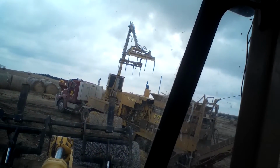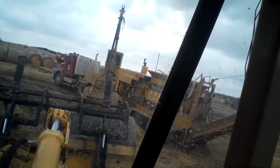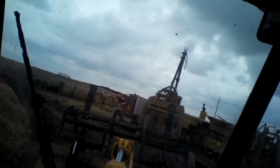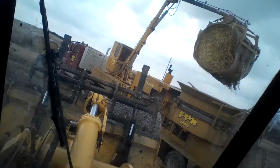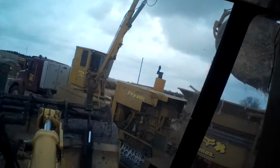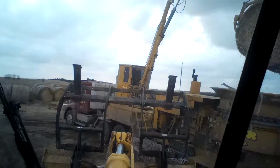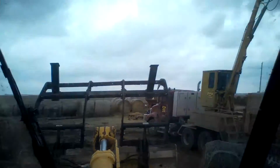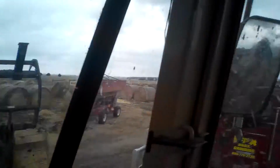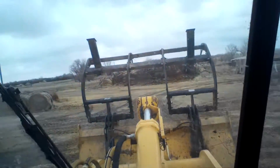I guess the other day when we had all the cluster mess in the morning there and we pumped our tank dry, we did ruin one of our pumps in the cistern building. Right now it still pumps, but it doesn't pump enough. It only pumps about 8 gallons a minute, and it should pump about 20 gallons a minute. So there will probably be a video on fixing that.